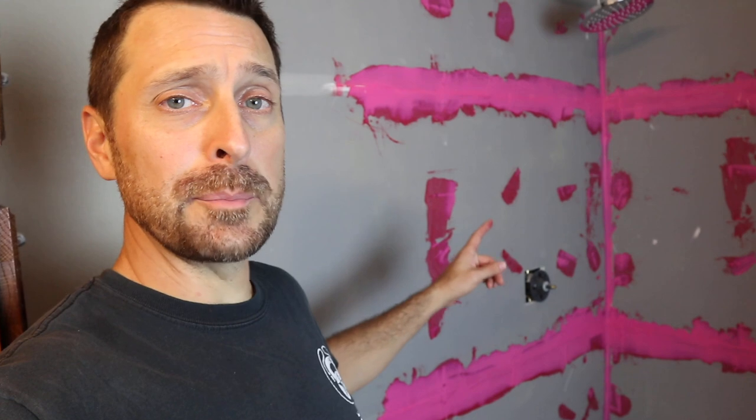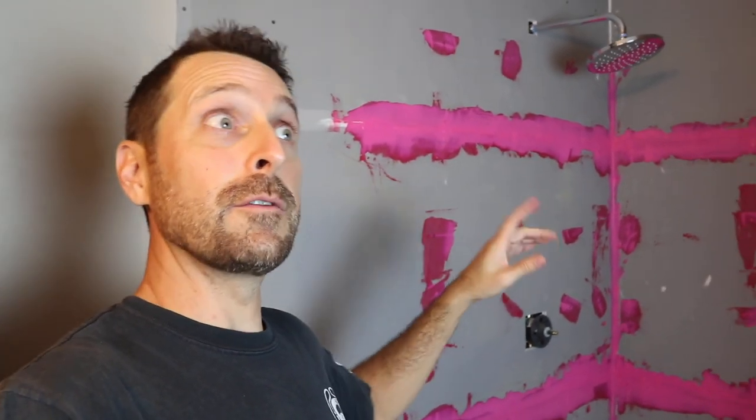The red guard was all over my hands, but here we go — we did the seams and the screw heads, we've got one coat on it. Red guard, to be completely waterproof, requires two coats and a certain thickness, so follow the instructions. It's really great stuff. I'll let this dry and then we're going to get another coat on it, but we are not going to get to the tile tonight. That's going to take an entire day because I go very slow and very methodical — but I know the wife is going to be very happy once this thing is done. I hope all of you have a blessed day and we will see you on the next video.